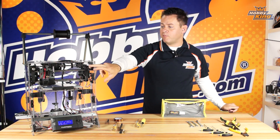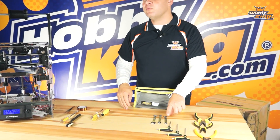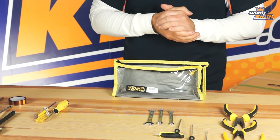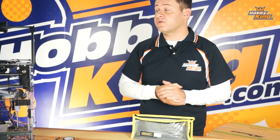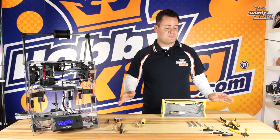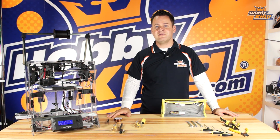Wrenches — there are a couple of bolts on this that you're going to need a set of wrenches for. The size range you're going to need is basically 5.5mm through 12mm, so if you've got yourself a couple of open-box wrenches like this, you're going to be A-OK for the 3D printer build. Now that we know what we need — a nice big clean flat surface and some basic hand tools — let's go ahead and dive right into the manual and get started on the assembly.